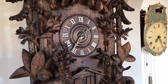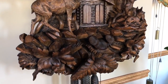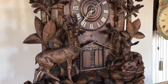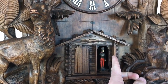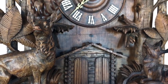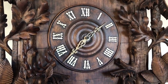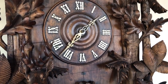This is a very unusual clock — it doesn't follow the normal variation of a trumpeter clock. It's a three-weight, quarter-striking example. Every fifteen minutes the double doors open and an original trumpeter figure appears, calling the quarter hours on three horns. Fifteen minutes after you get a three-note call; half an hour after, six notes; three-quarters after is nine; and at the top of the hour all four quarters are called on twelve notes.